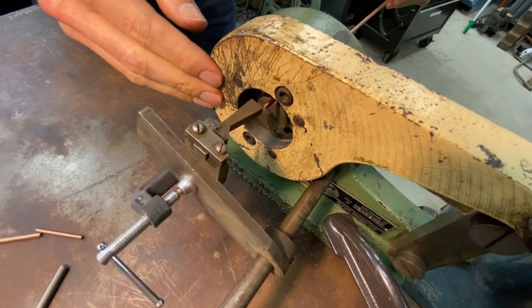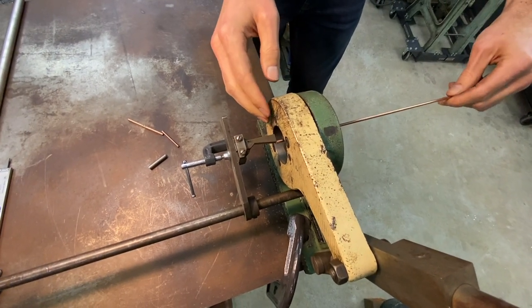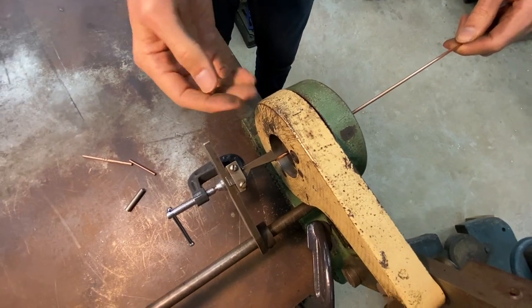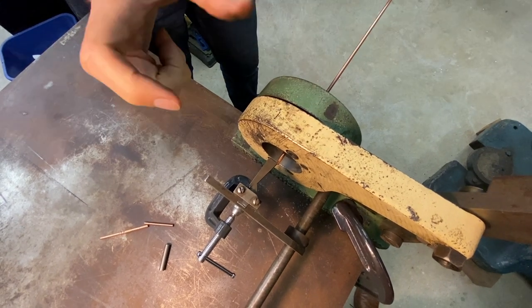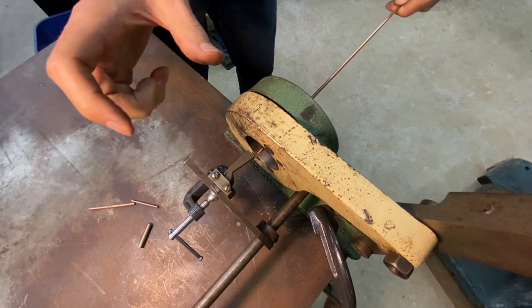And this little stop is quite amazing. Whoever designed this, I'm very impressed. Very simple, very reliable, easy to use, very precise. Literally, all you have to do is push on the material going in and pull the handle, and it will cut as many pieces as you want within about a 5 thou range is what I found.